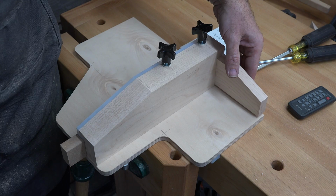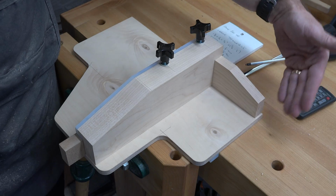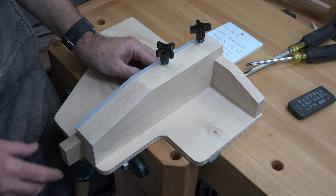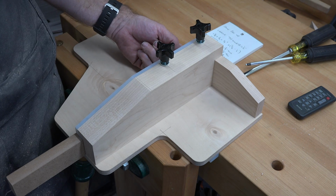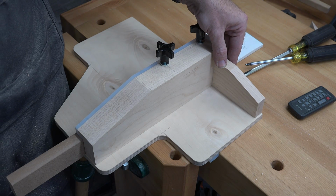And this piece will get mounted right there, on the right side of the fence if you're standing from behind it. So we're going to screw into this from up underneath with 2 screws, and as well we're going to remove this sacrificial piece and drill and countersink from the inside of the fence with another number 8 screw to get this nice and secure.